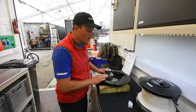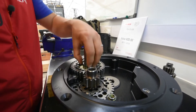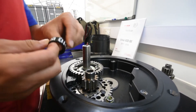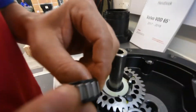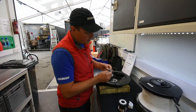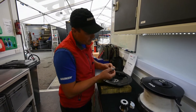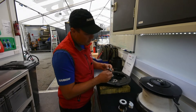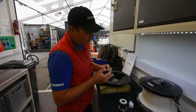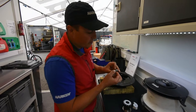The other things we've been looking at in the winch are the bearings. If I lift the final pinion off here, you can see underneath we have a number of roller bearings. These take all the load over the final pinion. We're basically going to feel around and make sure that all the little plastic parts holding the roller bearings are in place, and we're also going to be looking at the bearing itself to make sure there's no galling or marks on it.